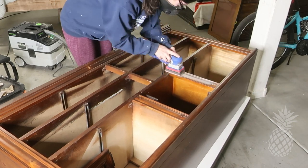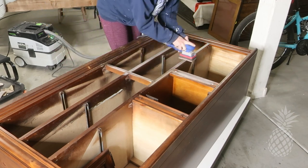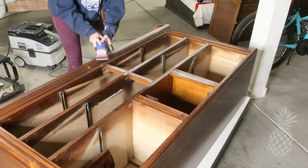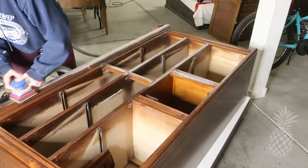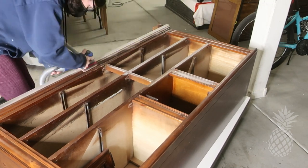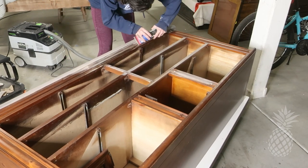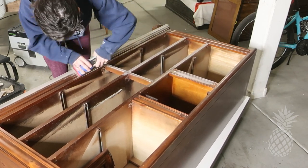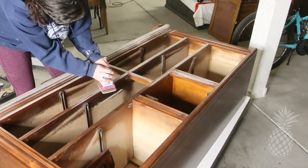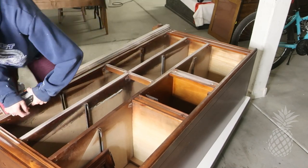It's sanding time, and time to ride the wave with that Surf Prep. We're just gonna scuff sand everything, but I like to always get to the raw wood first to see what that wood looks like. Unfortunately, after testing it out, none of this wood is gonna be salvageable. It's a very lightweight, soft pine that is just dinged to high heavens. So we're just gonna scuff sand it and paint it. Let's get a move on this baby.